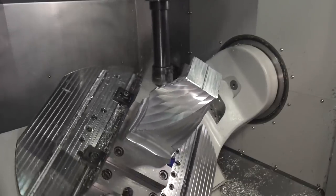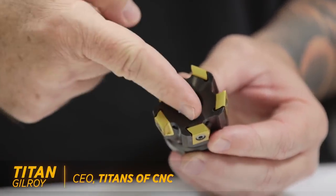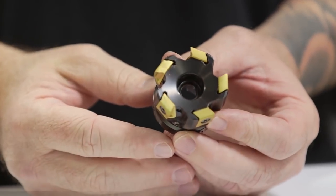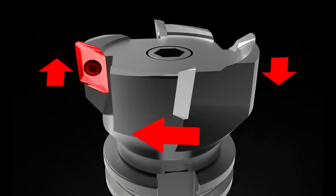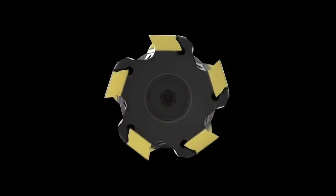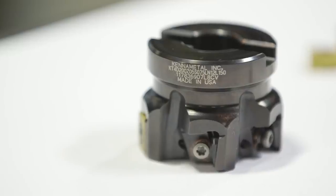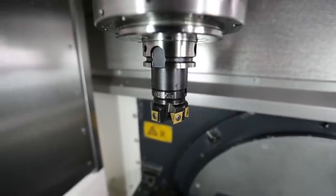Let's talk about it. Tangential — it is the way the insert is seated around the core of the body. A lot of times you have the inserts flat like this. It cuts in this way, and it's flat and it's thin. This insert, though, is in this way, which is tangent to the circle. So automatically I see some things that make this truly unique and rigid.